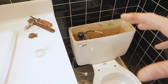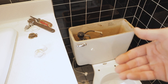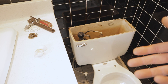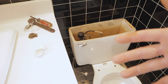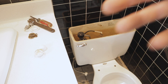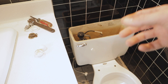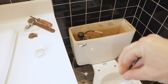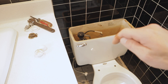Now we're ready to remove this toilet. Before you do that, if the location you're moving the toilet to is carpeted or a nice hardwood floor - somewhere you don't want wax from the wax ring - get yourself a thick piece of cardboard or plywood outside the bathroom that you can set the toilet on. The other thing you'll want is a large rag or several small rags to stuff down into the drain pipe.